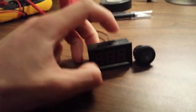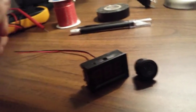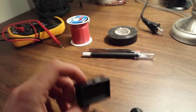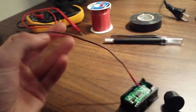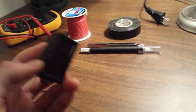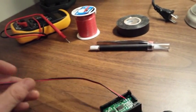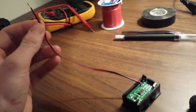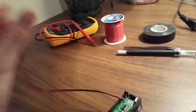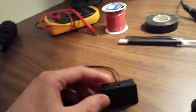I'm going to show you how to connect a voltmeter to your car. I picked up these two things off eBay. This is a digital voltmeter — it's the two-wire type. You can get a three-wire type or a two-wire type. I picked up the two-wire type because it's more straightforward. Supposedly it's a little less accurate because you're powering the device and measuring voltage from the same wire, but I'm not really looking for that much accuracy.